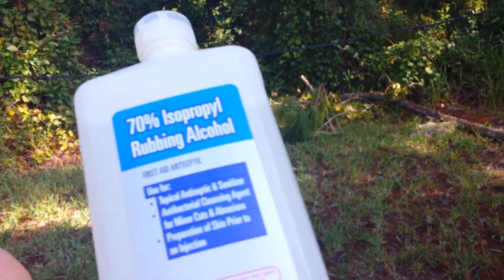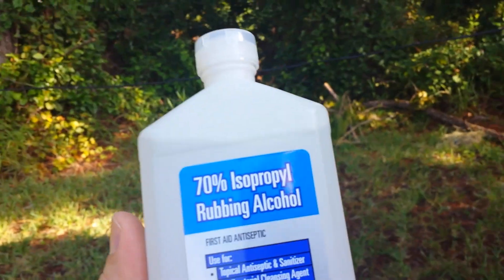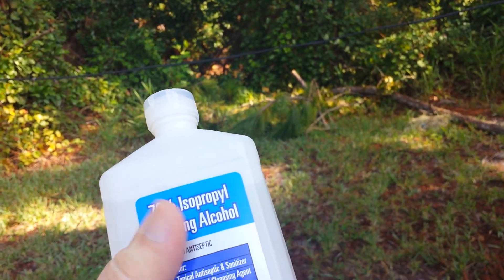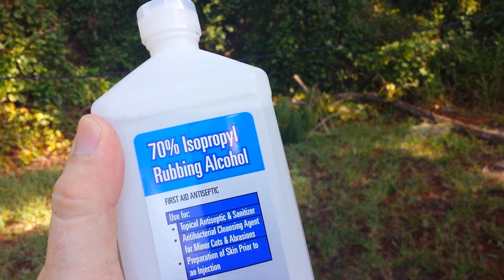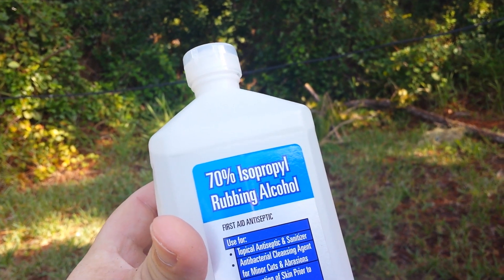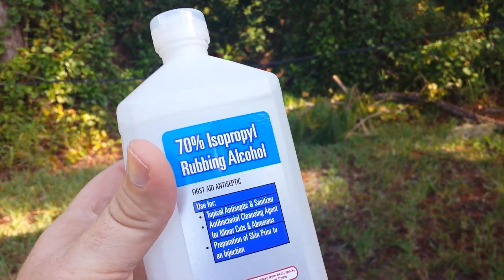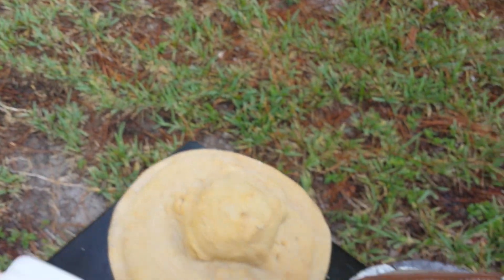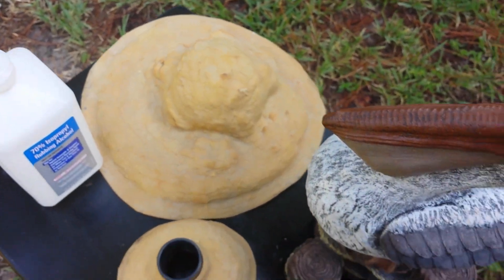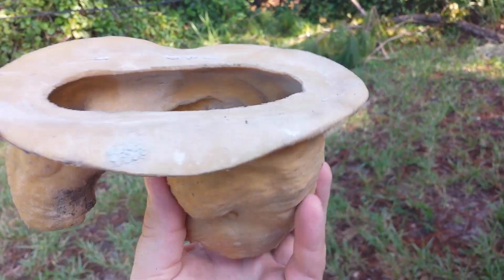My family's been doing this since the 60s. I've been in the business myself for about 30 years. Any mold company out there — not unless they're trying to sell their own brand of mold release — but any company in the latex rubber business will show you that you want to use rubbing alcohol mixed with castor oil. This is the 70% alcohol. Don't use the 90% or 100% — that's too strong. If all you can get is 90% or 100%, dilute it with water first before you add the little bit of castor oil. The castor oil is the actual mold release; you need the alcohol to dilute it so it's not too strong on the molds. Castor oil is not a petroleum product — it's a plant-based oil.